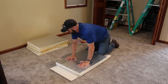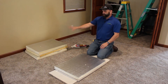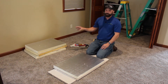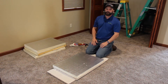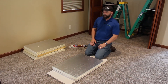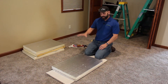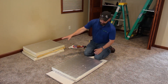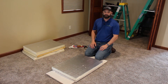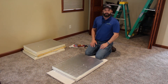What I'd also recommend is glue one piece to your drywall panel, then glue your other three, four, or five pieces up separately so that you can make sure we've got a tight fit up here with the shelving unit there. Just glue one to this panel, get it up and into the attic, glue these three together and get them up, and then glue the remaining pieces to the top of that one. That way you're positive they will fit through the hole and it will not all be for naught.